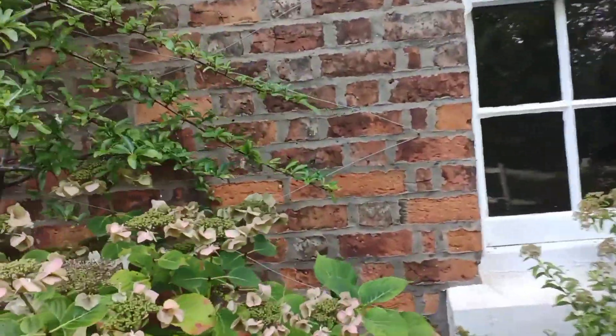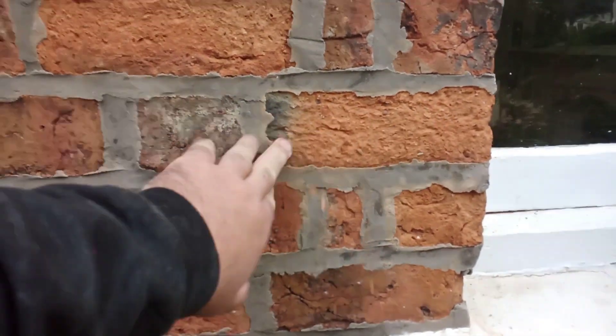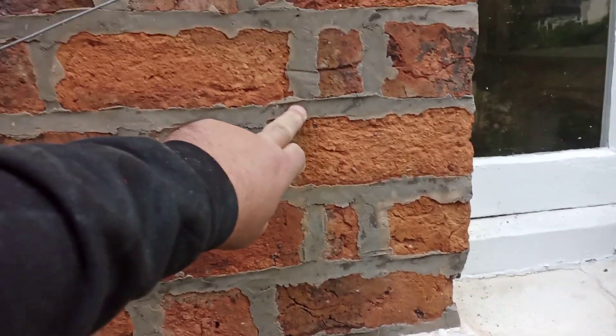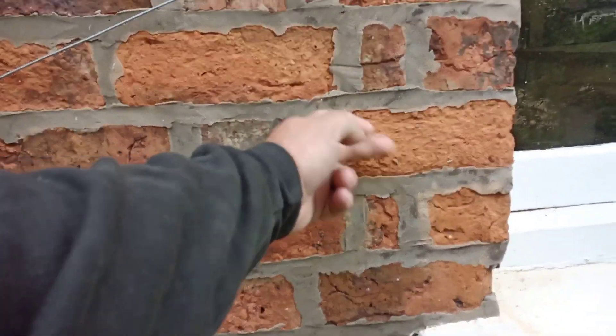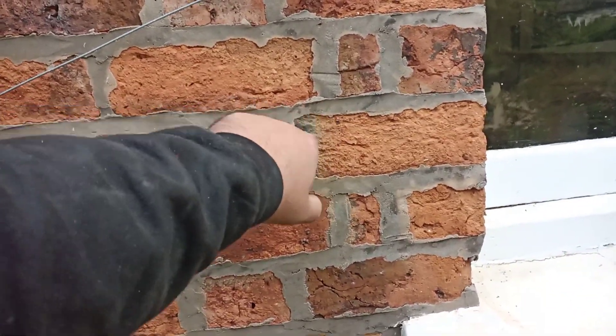See, this is what happens as well — it starts to damage the face of the brick. Because no more water can come through there, any moisture comes through the face of the brick. And you want this building to wick away through the lime, not the brickwork.